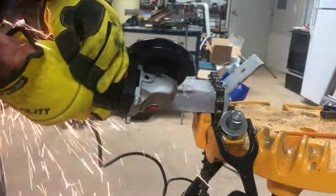Okay, and now it's time to cut our pipe. I used the portable bandsaw to do this, and I cut it at about 42 inches. You can figure out how long you want it. It's all your personal preference, as most of this, but I used 42 inches after measuring it on my boat. I measured back from the end of the pipe. 5 inches was where I determined I wanted to go ahead and weld the bracket up to the pipe.